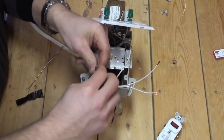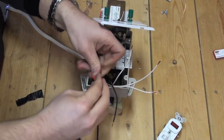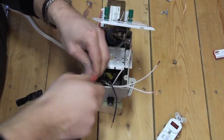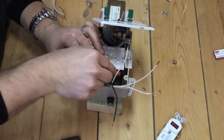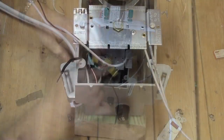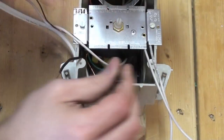You will also need to add a short jumper ground which will attach to the pilot light toggle switch. There are 4 wires in total. Splice all of the grounds together and bury within the electrical box, which should be held secure by the overlying dimmer switch.